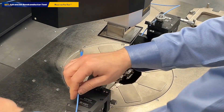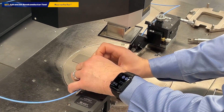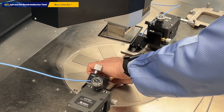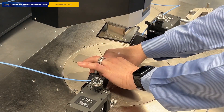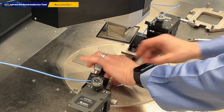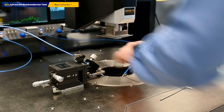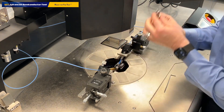Same procedure, same operation on the right inside probe. Guide it through the guide, move it inside, and connect the cable — the cable nut to the probe. Align them and carefully rotate the nut. Don't apply any pressure; the cable nut should actually move to the probe connector by itself. After it's done, simply use the torque wrench to fix it. We're done.